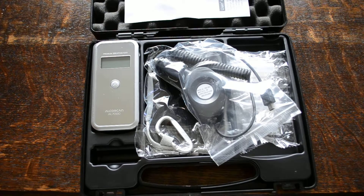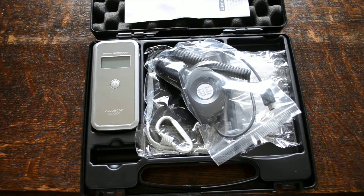Some of these units just refuse to test once they reach that 200 count. It may also indicate if there is damage to the sensor with an SEN or CAL display. This can occur more rapidly than 200 tests if the unit is used to measure high levels of alcohol, in which case the sensor will need to be changed.